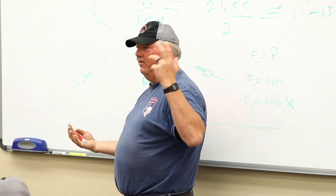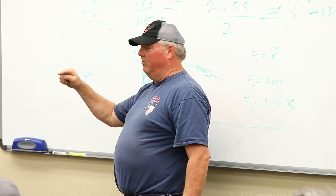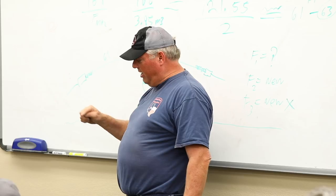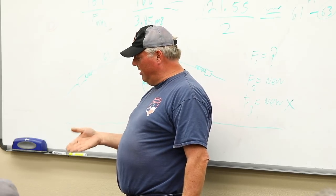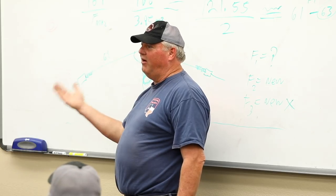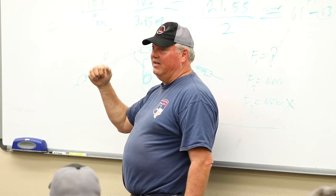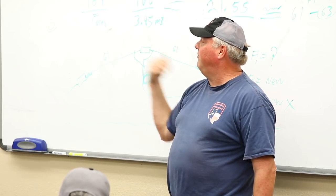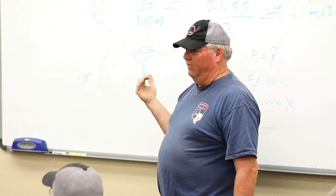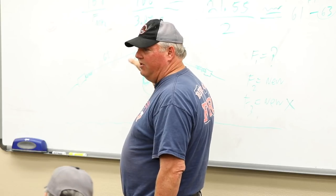I don't even know what it is off the top of my head. But you can put in, my feed line is this, my velocity factor is this, my SWR is this, my input power is this, and the thing will go bloop, and it'll tell you how much energy you get at your antenna, and it'll surprise you. The further off resonance you get, the worse it gets. So when you're taking these antennas, and you're pulling them back from the moon to get them to behave, it's not efficient anymore. So we're talking about resonant antennas that are made to work on a particular band.